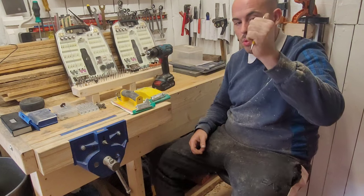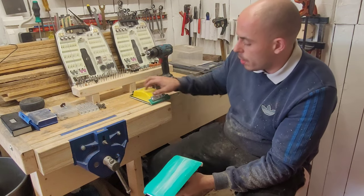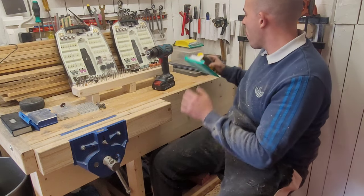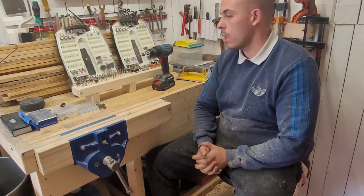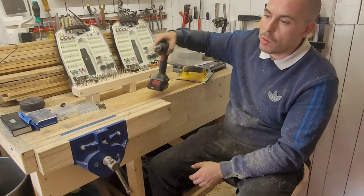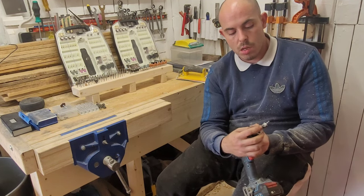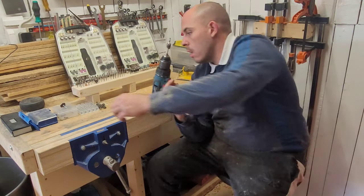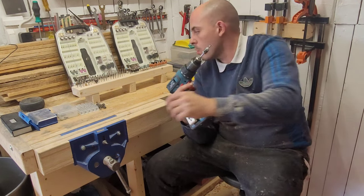So your pencil comes in handy. I like to use 9mm, more accurate than that. Bit of 180 grit, bit of 120 grit sandpaper, do your edges and that. So then I tried a 3mm drill bit, but it was too tight, so this is a 4mm, and I just adjusted this countersinker that's on the drill bit, so that would be about 2/3 down on most of them. Some of them are longer, some of them are shorter.